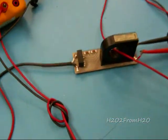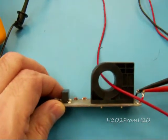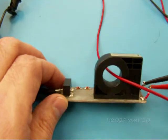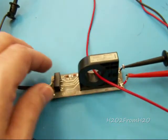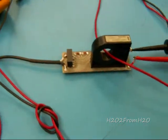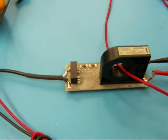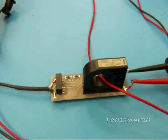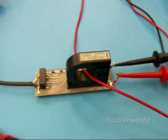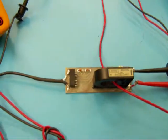This Hall Effect sensor is a continuous sensor. You are probably more familiar with the clip-on styles on portable meters. I chose this mostly because of cost. This whole sensor unit board and a couple of components — resistors and so forth — costs $32 to assemble yourself. If you choose not to purchase a board, that cost is about $26. All these parts are available at Mouser. And that's the basics of the sensor.